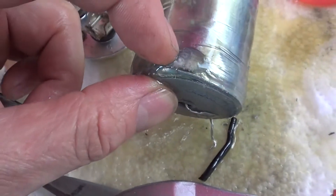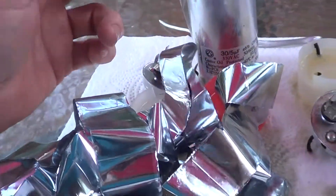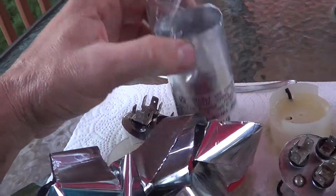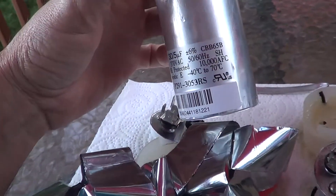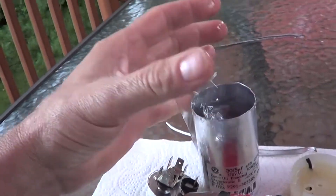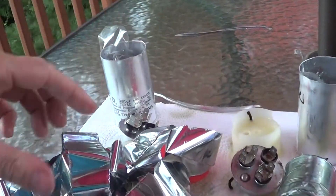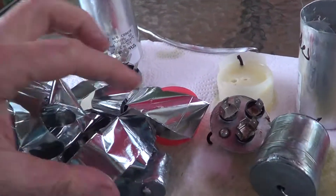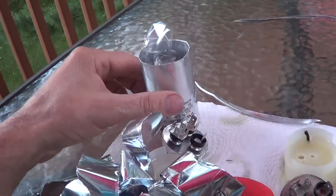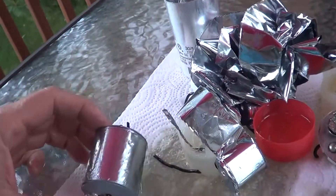But right there it's melted. So the failure mode on these things is the thickness of the plastic. I've seen all the brands going bad — GE particularly bad, this isn't a GE. But I remember in the 80s when I started the business, the capacitors used to be much bigger and they never went bad. I never had a bad capacitor throughout the 80s and 90s even. They just started going bad when they started getting really small like this. This stuff is really thin — it handles current because there's a lot of it, but when it starts arcing it destroys itself.